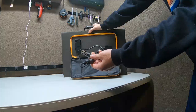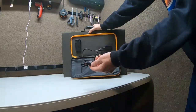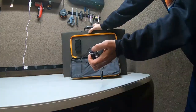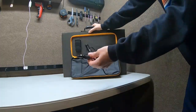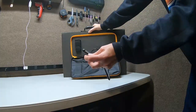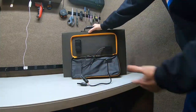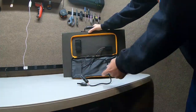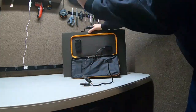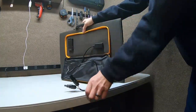MC4 connectors are literally waterproof — it takes a lot of pressure to get water inside one of these ports. The only way in is the input ports, but normally when connected, that's sealed with a little rubber grommet. That's why they're industry standard now — it's a great connection. A little hard to get apart with your fingers, but they make a plastic tool to pop them apart. The barrel connector that came stock is a 5521 or 5525 size.